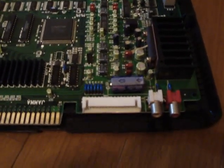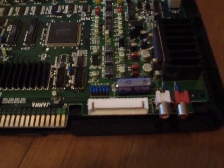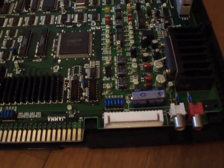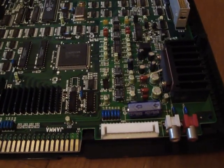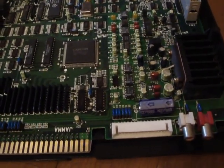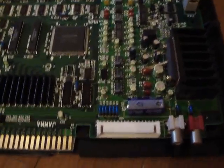What I did first is I checked online just to see what the pinouts were and what was needed, and basically you only need about 7 or 8 wires here for the CPS2 board for 2-player. If you go for 3 or 4-player, you need all of them, but since I'm only doing 2-player, I only needed about 7 or 8. But the hardest part was looking online and trying to see what the different pinouts were.